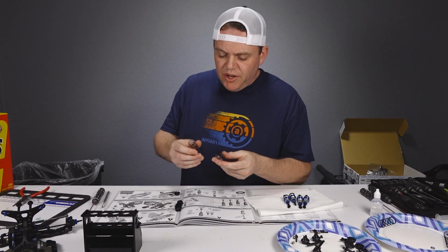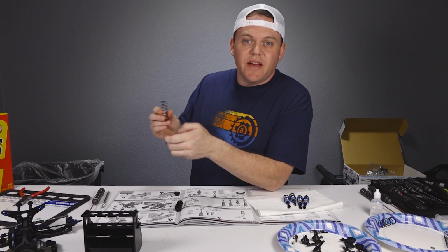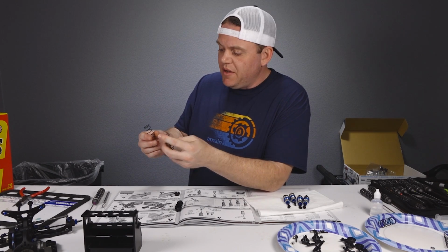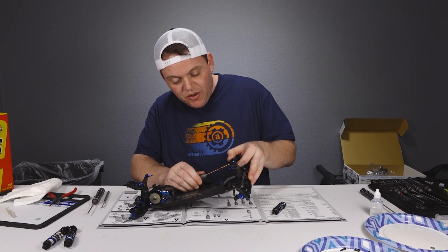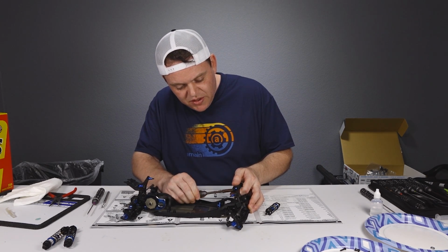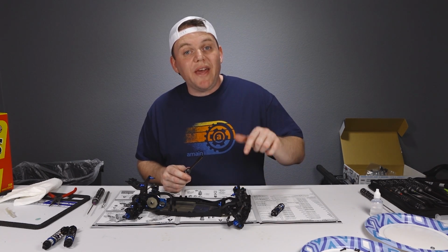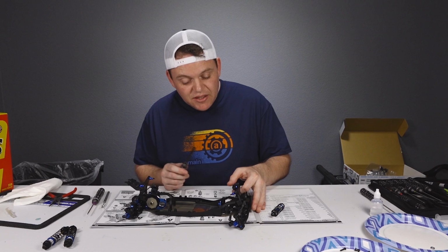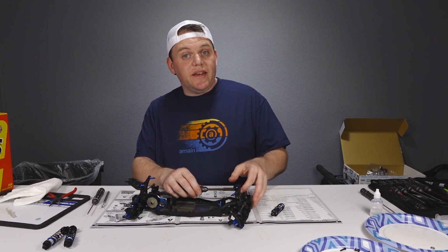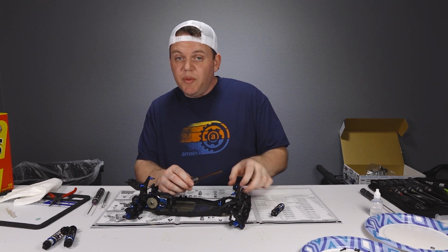When it's time to put your springs on, if they're color coordinated, often they are, you can put that color at the top of your shocks so you can identify what shock springs you have later on. When it's time to install the shocks on the vehicle, attach the shock to the shock tower first, put the nut on or whatever system is used, tighten it down, and then ensure that that shock moves freely. The bottom shock mount point at the suspension arm is less critical, but sometimes when you use a nut up on the shock tower to secure that shock cap, it can pinch the cap a little bit, causing a little bit of bind in the movement of the shock.